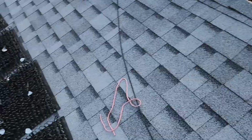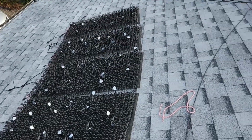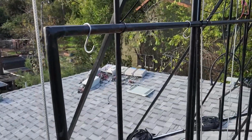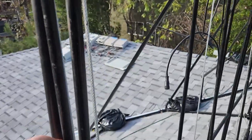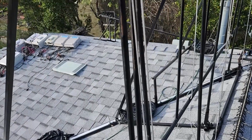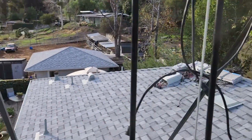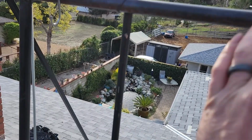So just like that, the matrix is down on, excuse me, on my roof and ready for me to roll up. Coming back to the frame here, it is 3/4 inch 14 gauge steel, and then I used 1/2 inch ribs in between. These are the spacers, and that allow the exact 1/2 inch pixel to pixel and allowed me to zip tie it together really tightly. It's just then zip tied to my other frames, and I'll cut those and I'll just take this off.